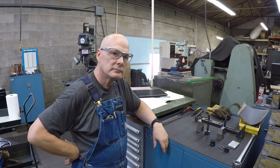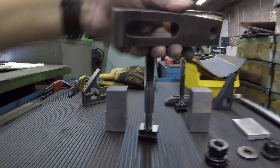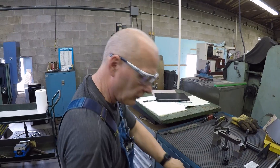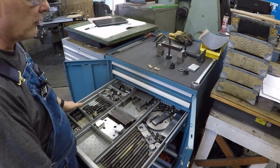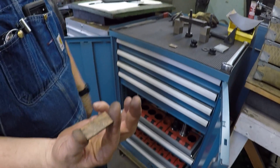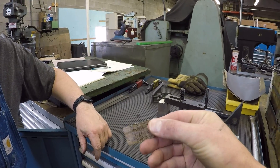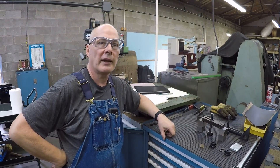A lot of times strap clamps come to a slight taper and a point but still have a flat bottom. This one has a slight radius on there, so when you're at an angle you're not having it contact flat — that gives you a little flexibility. When you want to be gentle with parts, take a strip of copper — half inch wide, eighth inch thick — cut pieces off. If you're clamping aluminum, copper may not be soft enough; you might need nylon or something between there so it doesn't bruise it.